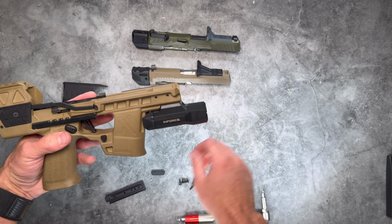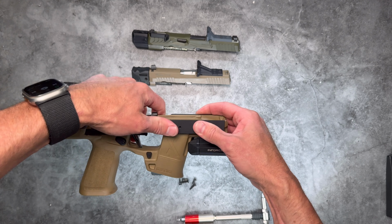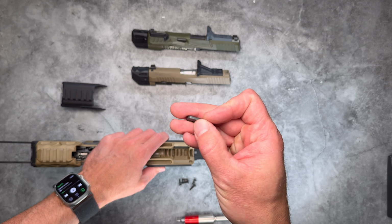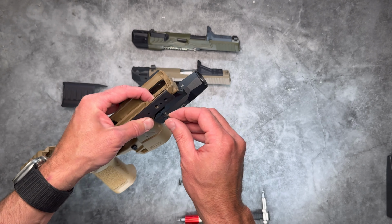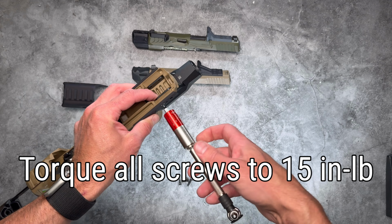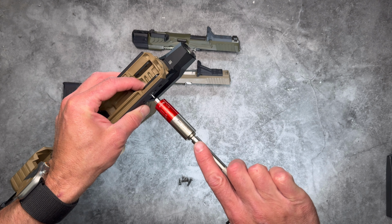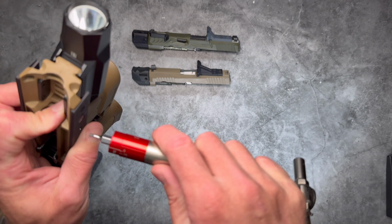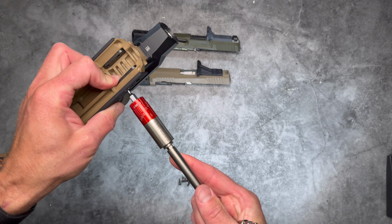Let's flip it over. Let's do the same thing. And if you do need to tap it with a hammer, go ahead and tap it with a hammer. Again, holes up top, small gap in the back. Throw in the Loctite on here and tighten that down to 25 inch-pounds. I'm trying to rotate this so I can see it. 25 inch-pounds. And there we are.